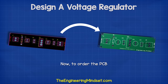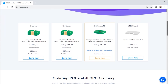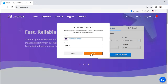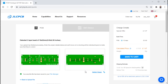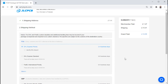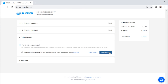Now we need to order our PCB. I'm using JLCPCB who have also kindly sponsored this video. They offer exceptional value with five circuit boards for just $2 — I'll leave a link in the video description down below. I'm just changing the shipping destination and currency to the UK as that's where I'm based, but you can choose your own country and currency. Now I simply upload my Gerber files and it will produce a preview. I'll choose the quantity and then leave the rest as default. Then I'll save this to cart, go straight to the checkout. I can choose the postage option to decrease the cost, but I want this quickly so I'm going to order through DHL Express. Then we just submit our order and pay — simple, done.